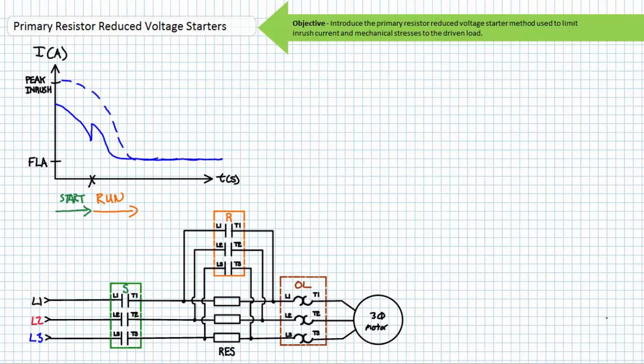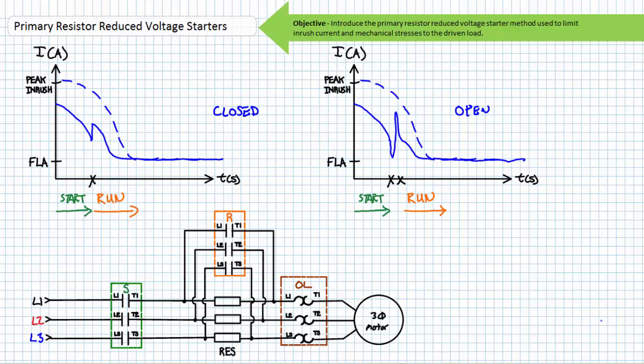There's always a pair of hands under it ushering it along, with no jarring disjoint in the transition. This isn't always the case for other reduced voltage starter methods. Consider an open transition reduced voltage starter that must necessarily de-energize a spinning motor even momentarily during the transition from start to run — this produces transient spikes that do not occur in a closed transition starter. The spike is a product of the open transition between the two X's. Open transition starters try to minimize the transition time to minimize the disturbance; however, it is an intrinsic characteristic of open transition methods.